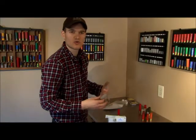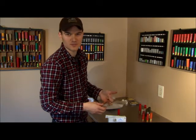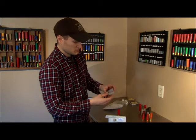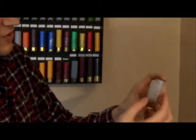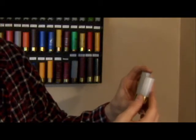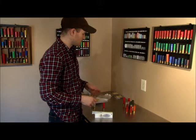As I mentioned, when you're roll crimping, you're only going to get so many uses out of the hull because of the deformity to the plastic when you actually roll it. So when you're trimming, effectively you're taking lengths off. So imagine this is our 2 3/4 inch hull. After we've trimmed one down, our next use out of this hull is going to be at a 2.5 inch length.